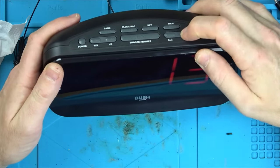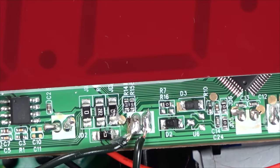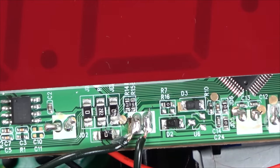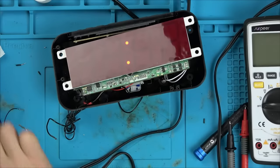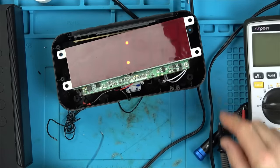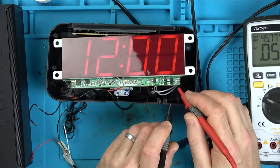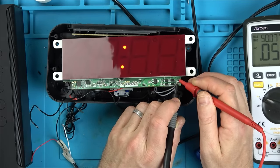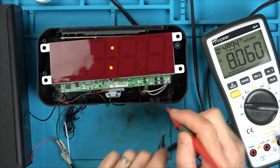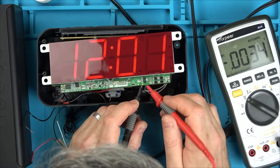No sound. Let me get my Bluetooth speaker with a probe on it to test the audio output directly. The transformer is AC to AC at a lower voltage — there's a bridge rectifier to turn it into DC, coming up as 8 volts at that point. So I feel safe working on the board, but remember it's 240 volts at the bottom of that transformer. Then it goes through what I presume is a voltage regulator — 5 volts coming out.